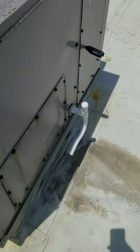I'm at 56 degrees supply air and was running about 78 or so on my return. Not the best place for the supply air, but it's at least running until we can get a new unit in here.